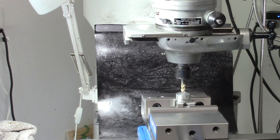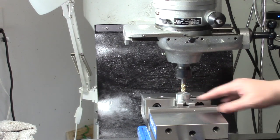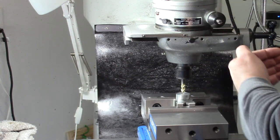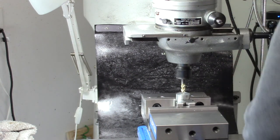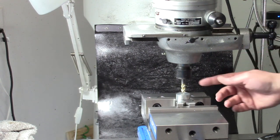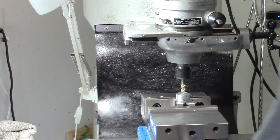So, we need to make this just under a half inch end mill, barely fit this. I need a little clearance, so we're going to make this like 495. So we want 248, but we also need half of the end mill, which is 187. Okay, get my shop calculator. 0.495 divided by 2, which is 247, 248, whatever. That's fine. And half of the dimension of this, which is 187, so plus 0.1875, that's 435 from offset.